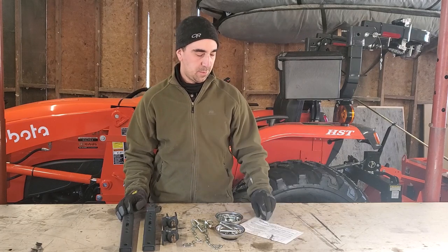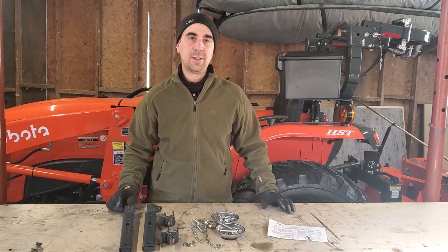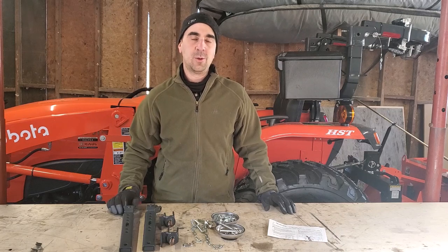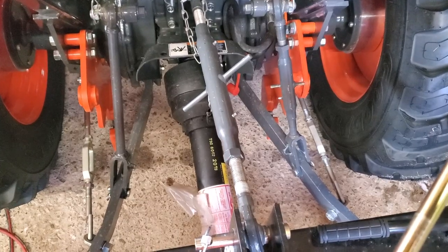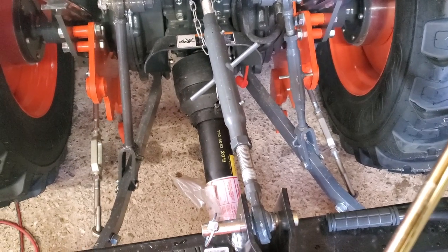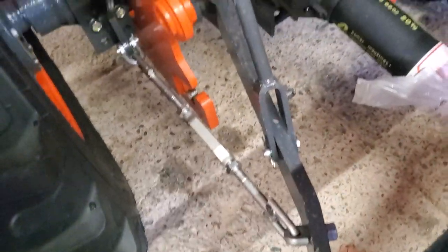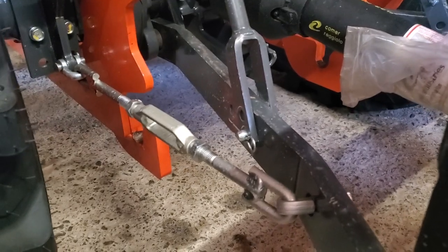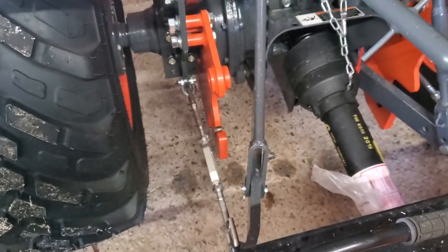That's what the kit came with. I didn't really look at the instructions yet, but I'll kind of go step by step — I've watched a couple videos in the past. What I'm going to be replacing is those two arms on the sides. As you can see here, those are the turnbuckles. I'm not a big fan of those, so I'll just unbolt this, remove the pin, and then install the telescopic arms.